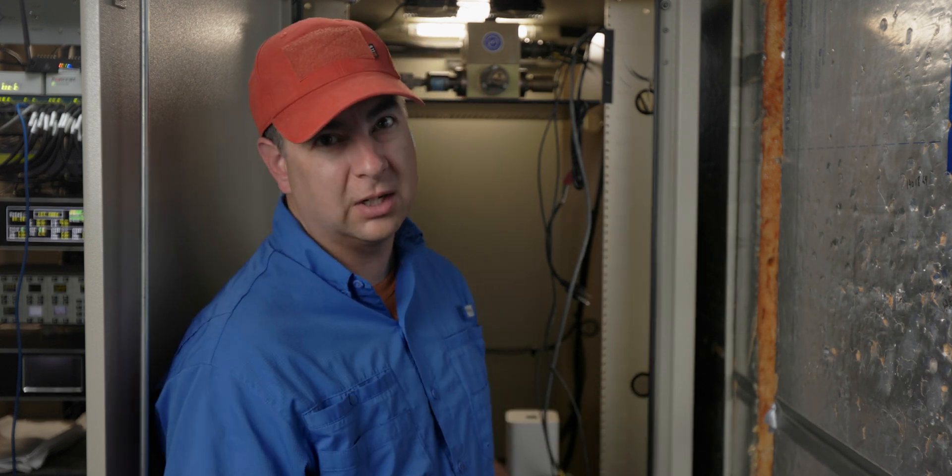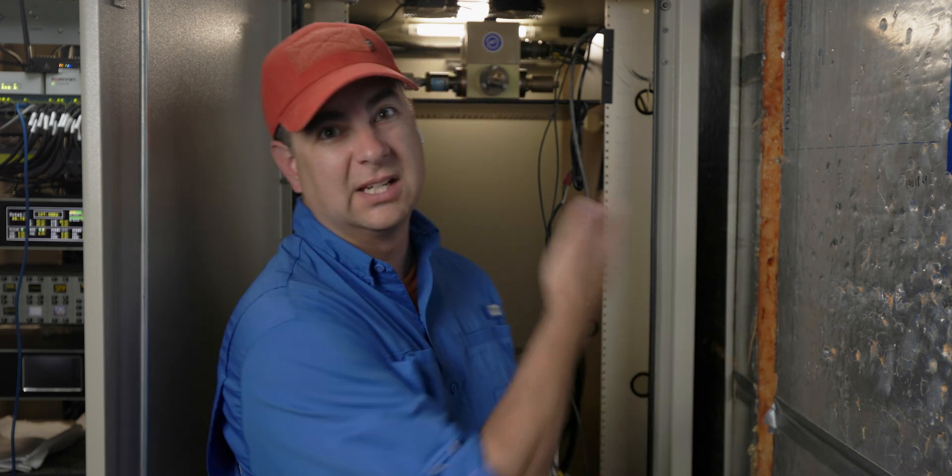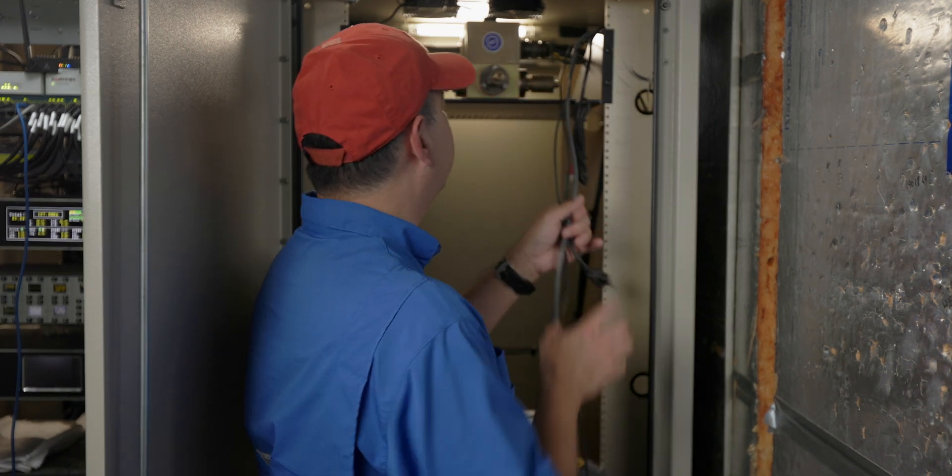The easiest way to handle that is with the interlock on the back side. Interlock is a safety feature of transmitters — when the interlock opens, the transmitter goes 'something is not right, I need to shut down.' Like if you were to open the door on a transmitter, it shuts everything down so you don't get shocked or hurt. In this case, for a coax switch, it will not be safe for the equipment if you switch it under power — so it tells the transmitter to turn off. Pretty simple.